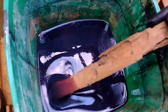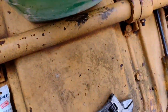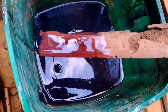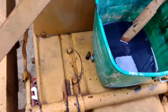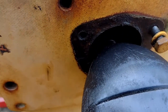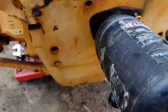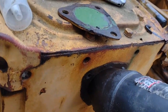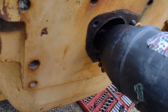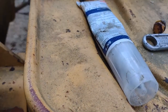I just drained some oil out of there — didn't get any water. Looks like maybe a little transmission fluid is leaking in there. It doesn't look great but it doesn't look bad, and I'm not paying for the oil, so we'll just replace what came out. No water in there, so it's sealed on top. The PTO seal was leaking — I could see rust on the bottom of the hole — so that's going to get a generous helping of silicone sealant.